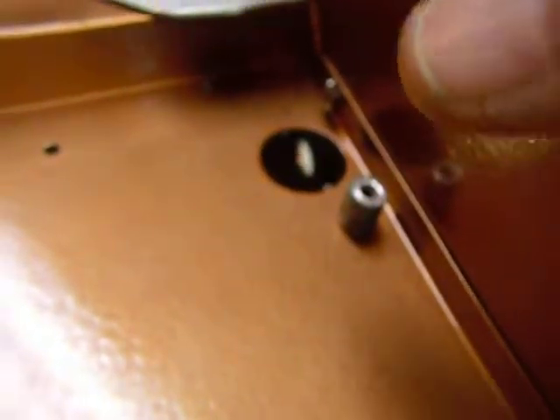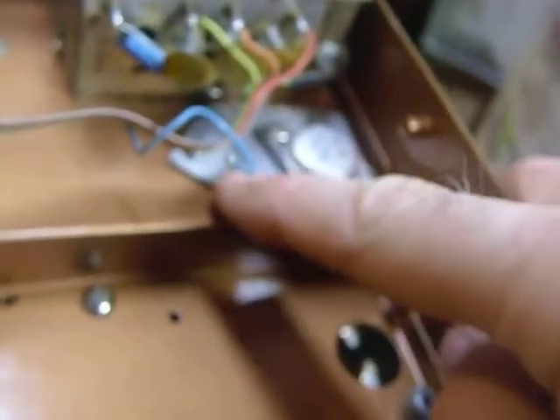I have spent quite a lot of time on this. Please ignore the blurry picture because I'm using a handheld Casio camera. This is the chassis, and this is the area where the big spill of battery fluid was — it was all corroded. I've cleaned it all up: I washed it in the sink and sanded it with 220-grit wet or dry automotive-type sandpaper, then painted it with Krylon Fusion spray paint in the copper color to restore it. I also added a piece of aluminum underneath transistor Q1 for a better heat sink, because that paint would not allow good heat transfer to the chassis.